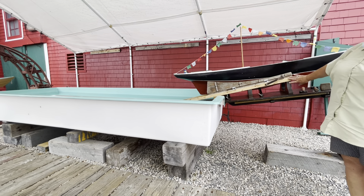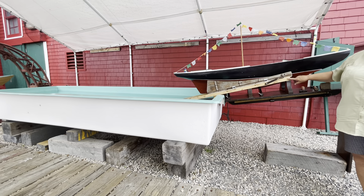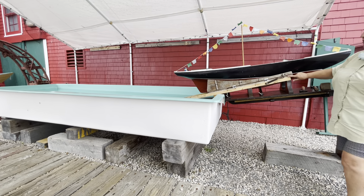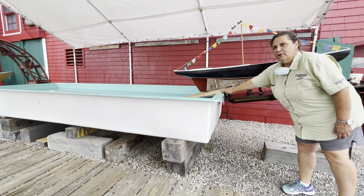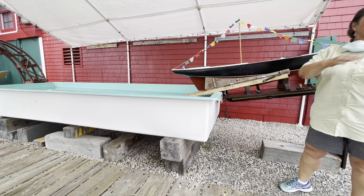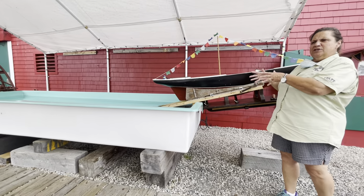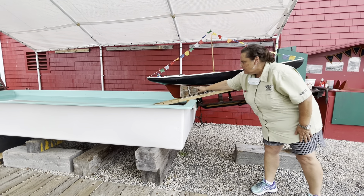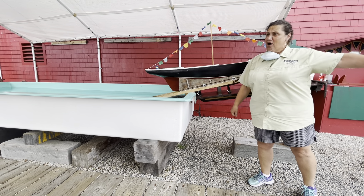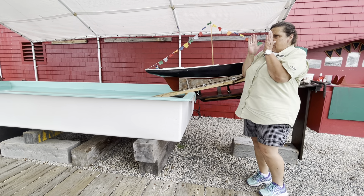A few days before launch, we have to put in the slide for the vessel to get it in the water. The first timbers we put in are the stationary ground ways that go in on an angle — they will not move. Everything else on top of that is a movable timber, and we have a slider that will carry the weight of the vessel down. This packing — the loose timber stacked on top of one another — is stuck in around the hull so she doesn't tip as she goes down. We have big timbers called strong backs with the heaviest chain wrapped around them, going right underneath the boat to keep it nice and tight.